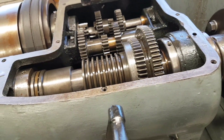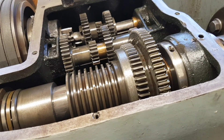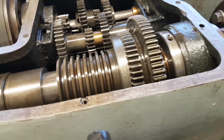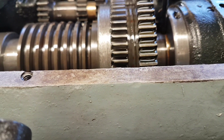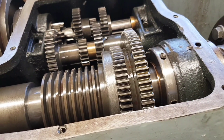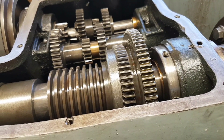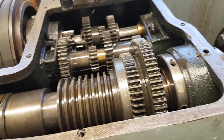The other thing I've got to consider is the fact that this probably hasn't been adjusted in years. So I'm thinking the bronze bearing is now running slightly further down the shaft in an area that's never run before. That pick up might just be a case of the bearing picking on the new area of metal and it might need a little bit of time to settle, so I'm going to have to monitor it.